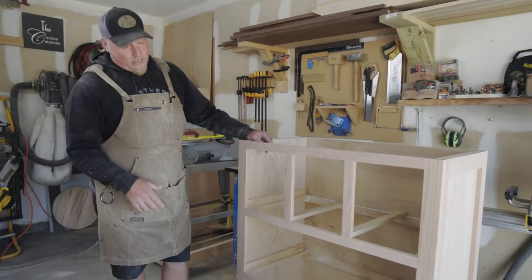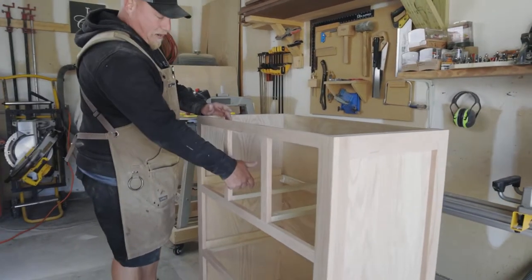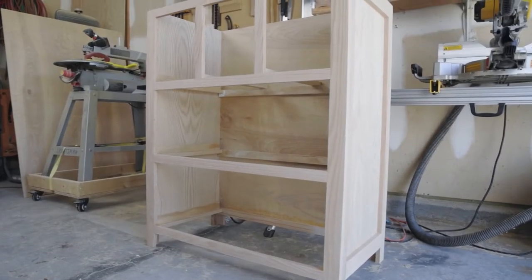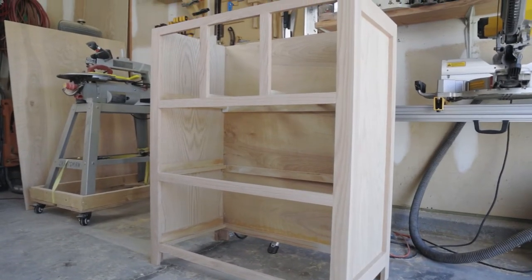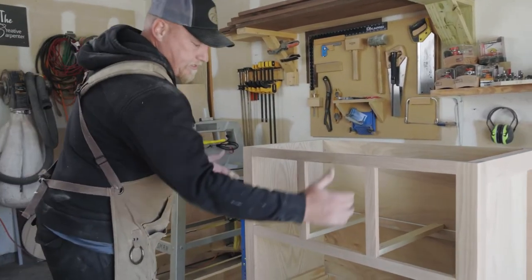Here's the cabinet frame, constructed out of red oak, and we have just made the face frames out of an inch and a half dimensional lumber. We fastened these using a pocket screw system so it'll be nice and sturdy. The layout of this cabinet is going to have nine drawers — you can kind of see the three drawers on the top already starting, and we're going to mimic this on the bottom.